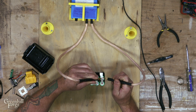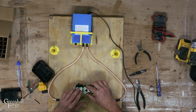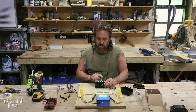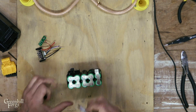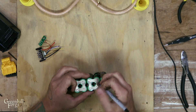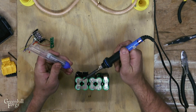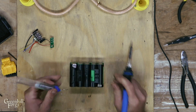From here I can go ahead and weld all these together, working my way down, then flip the whole thing over and do the same. The beginning of the series is on this side so it looks just the same. So the cells are all welded in place and now I can go ahead and get the BMS attached. I'm going to go through and label the voltages of each point, because that will help me solder on the correct wire from the BMS. Starting at the negative end, this is 4 volts, this is 8, this is 12, this is 16, and at the end it would be the full 20 volts. I'll go ahead and add a bit of solder at each connection point because it'll make the actual assembly easier, and here at the top on these two tabs I'll add a bit more.